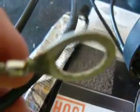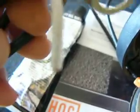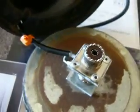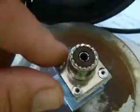Here's the old piece — you have the lug connector and the center piece of coax. This one actually just broke out of the SO239. I don't know if it was from stress, but it's riveted on so the SO239 could not twist. Anyway, it came undone. The owner thought it was a bad piece of coax and cut it, but there's no sense in buying a new one.